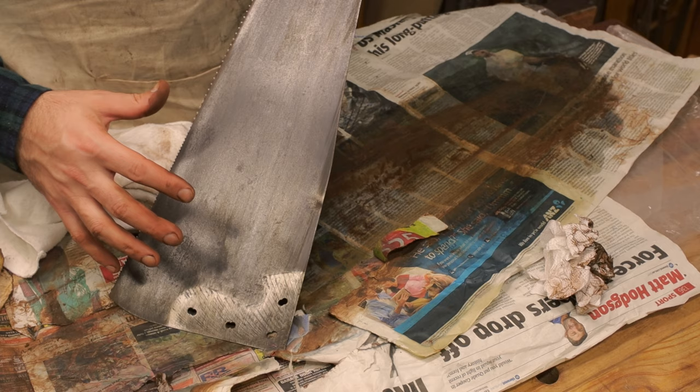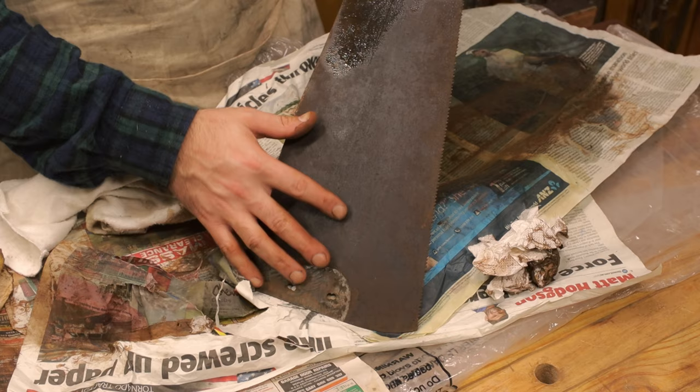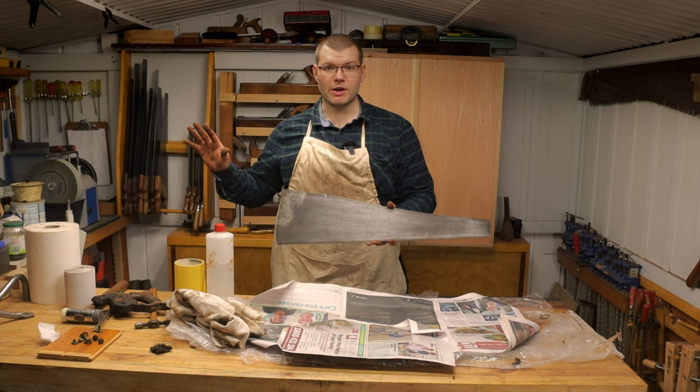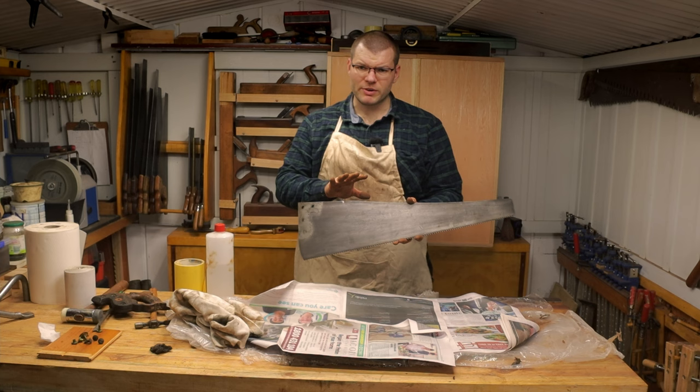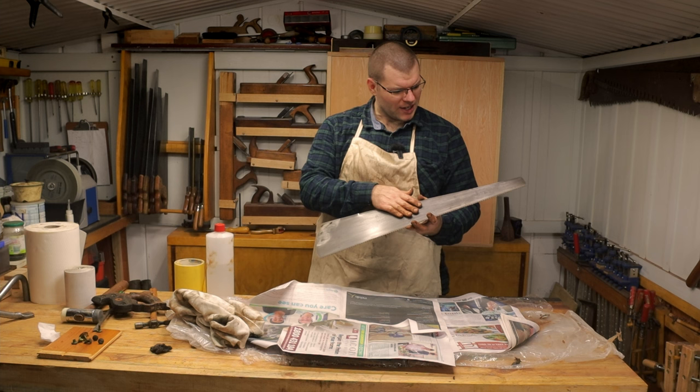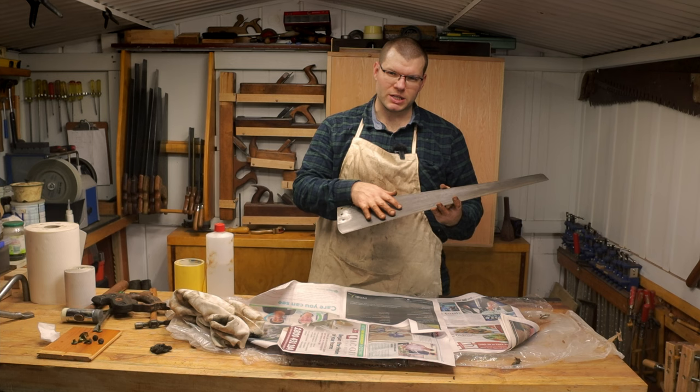So now I'll turn it over, complete this side first. Once I've done that, I'll come back on with the 240. We will also clean up the edges of the plate and then move on to the handle. It's time to grab the 240 grit sandpaper and continue with the same process. If there's not so much dust flying around, you don't necessarily have to use methylated spirits or denatured alcohol at this stage. The fine sandpaper will continue to refine and smooth the surface and remove the smaller bits of rust in between where the heavier sandpaper goes.